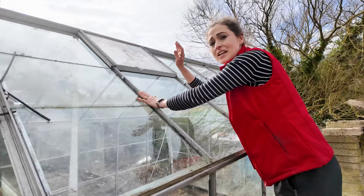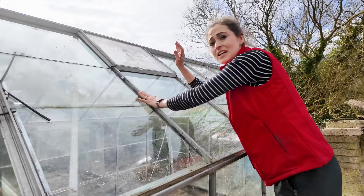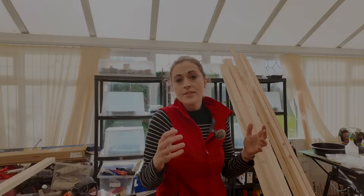The last thing I need to do is this window opening. We do have some perspex over there, and looking at the size it does look like the same as the larger ones at the top, so hopefully I don't have to make any cuts. I found an old ICI perspex sheet — needs the film taking off. I try to slot it in but it's a little bit too long and sagging. I've now measured: 25 millimetres needs to come off. I masking-taped it, marked it, and I'm ready to cut. The perspex just shattered when I hand-sawed it — it's brittle. So now I'm using it as a template to cut proper glass.